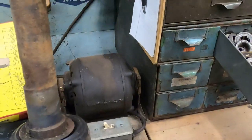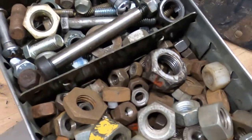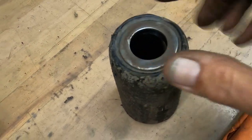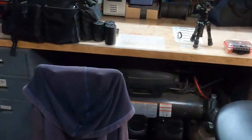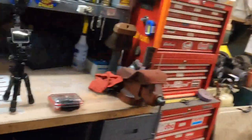These parts have just been collecting dust in his garage, and he and I are seeing what we can work out. So I may end up with some nice shiny new parts. There's a possibility I'm going to be checking compression on all six cylinders. The engine has 150,000 miles — that's a good number of miles, but if it's been taken care of, it's not too bad. Thinking about getting a short block. If I get a short block, I can do the valve seats and valves, put new springs and a hotter cam in, as well as a dual intake manifold and a split header to give the little engine that could just a little bit more oomph.